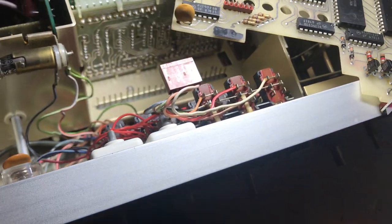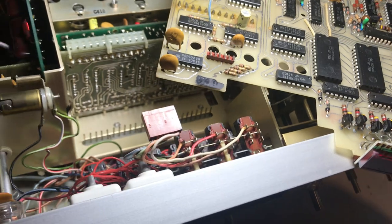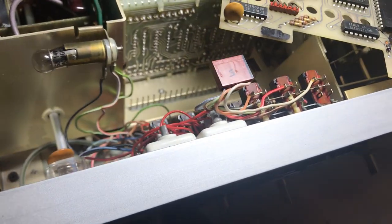There's also a gray wire on the board, and that goes right about here — there's a pin right there. That's where the gray wire goes. They're both gray, but that little wire goes right there. And so the hardest part is getting the board out. You probably have to make a hook. Do not pry this with a screwdriver — you will definitely regret that.